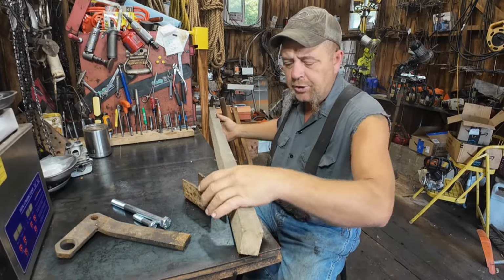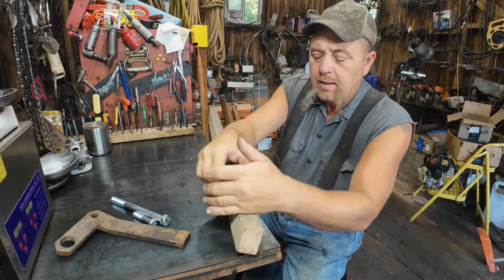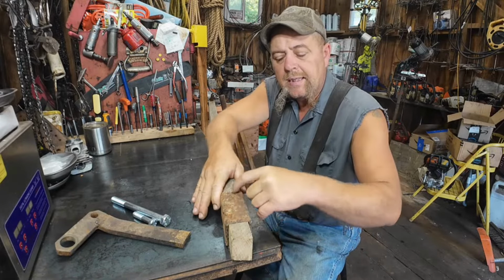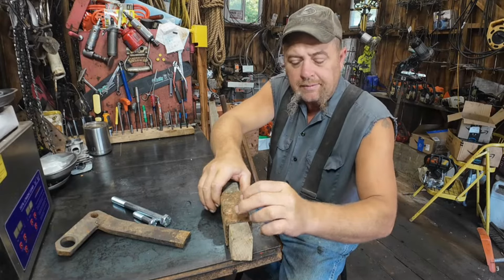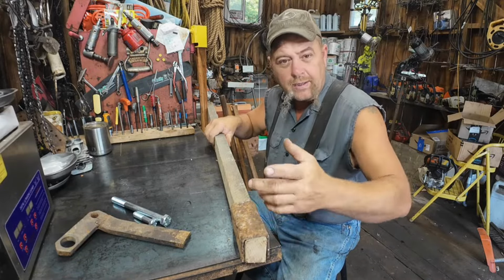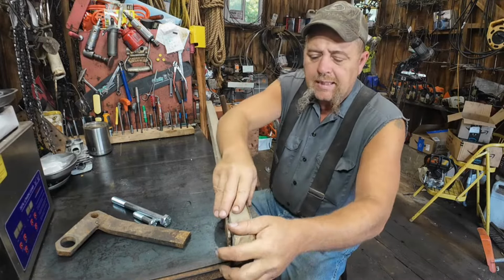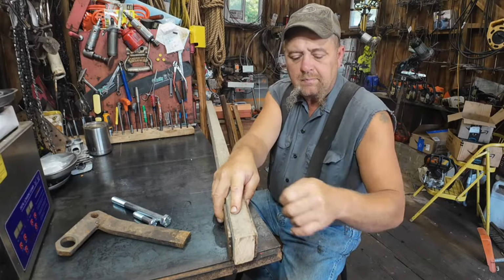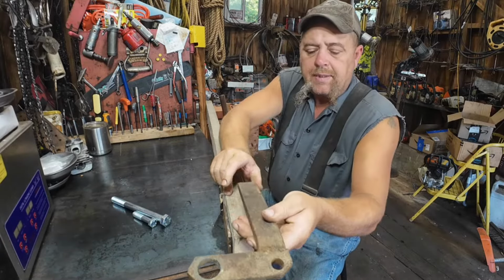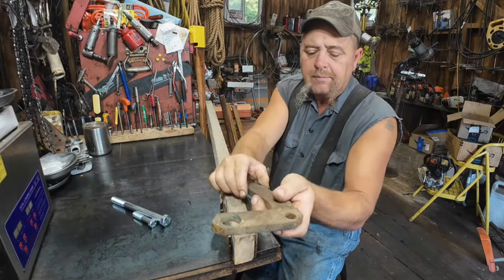So what did we do? Well, like I say, we took this piece of ash, and I had a piece of 6-inch channel, the other end's right there, and that was a little thick. It's a little loose on there, so I split that down through there, clamped it back together, and welded it, right? That way it just narrowed that up just a little bit. If I'd have had wider lumber, of course, or shorter, I wouldn't have needed it. Now, on the back side of this, I cut that up so it was just a little bit proud of this, okay? And then I took me a piece of 4-inch, about 4 inches long as this.